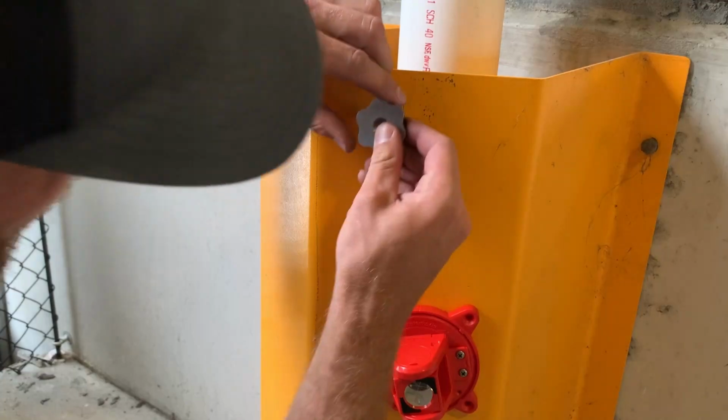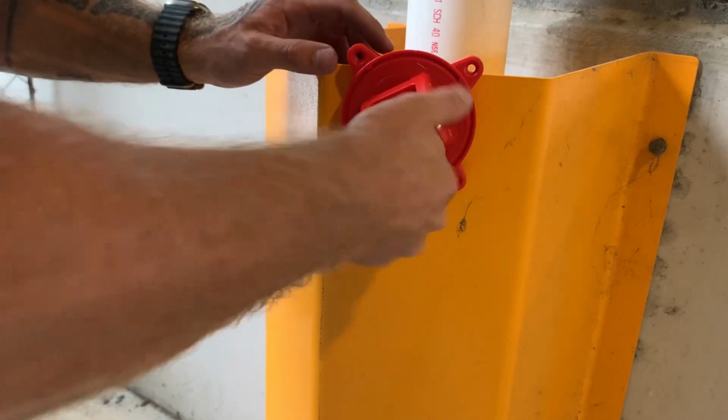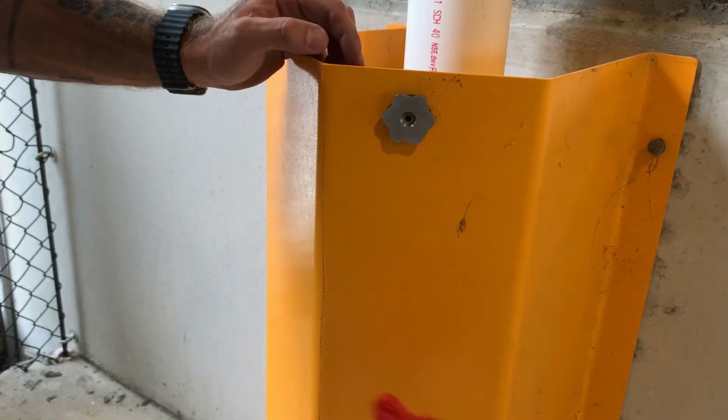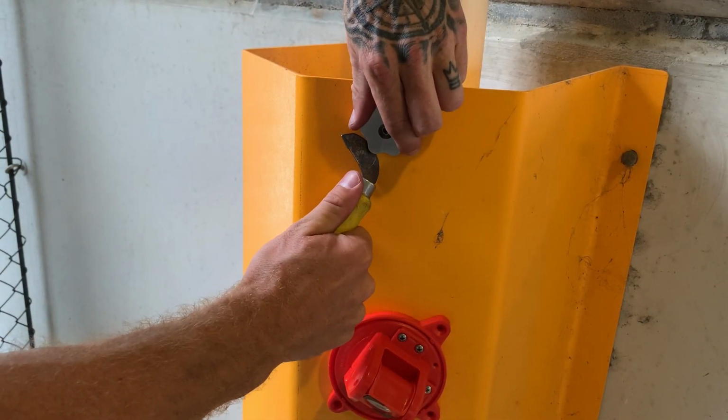I set a dimple or pencil cross or scribe on a steel surface, then simply set the disc and magnet centered over the mark. The magnets I got never move when I don't want them to and can actually be pretty difficult to remove, so I suggest having some kind of tool to pop them off rather than sliding them to an edge. I'll leave a link in the description of the ones I got off Amazon, but any similar magnet should work fine. It took me 5 minutes to make 10 and the glue has held up fine.